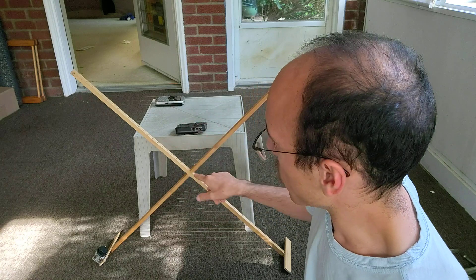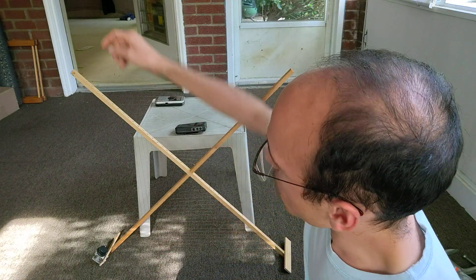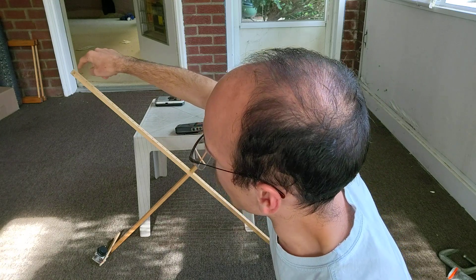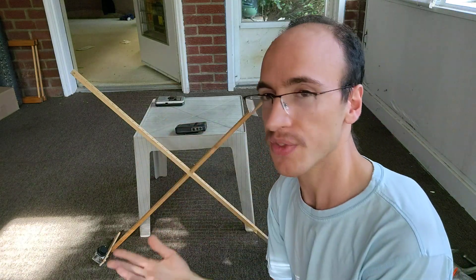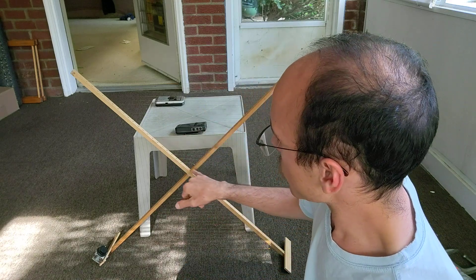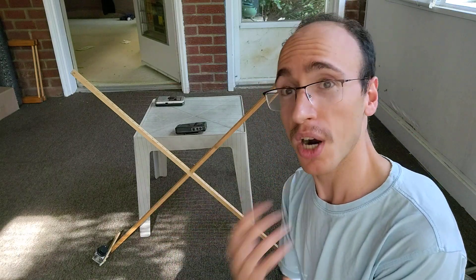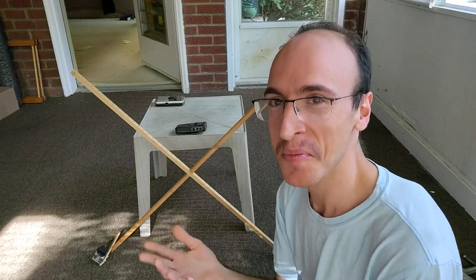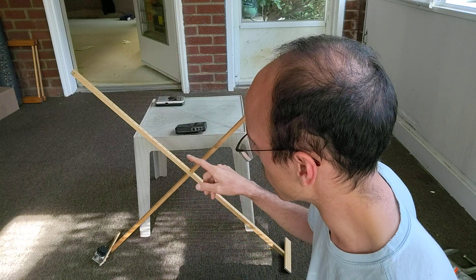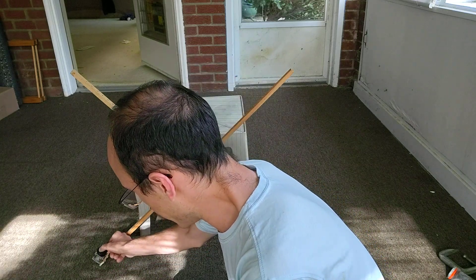So before I put the two pieces of wood together, I needed to drill those holes for the spiral wire pattern. I did this by starting two inches from one end of the shaft and drilling 20 holes down, spaced three quarters of an inch apart, which people in Facebook groups suggested was ideal for making the loop. After I drilled those holes and glued this together, I then wrapped the spiral very carefully from inside to outside, weaving it like a loom. And that was hard, but it was actually quite satisfying - a real zen experience wrapping the wire through that coil. So it's 20 loops total, then tied to the stator and rotor of this 365 picofarad capacitor.